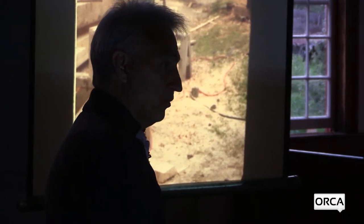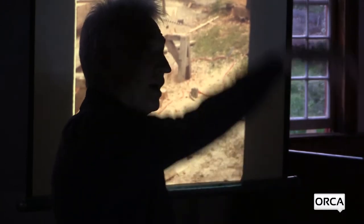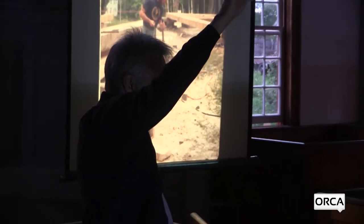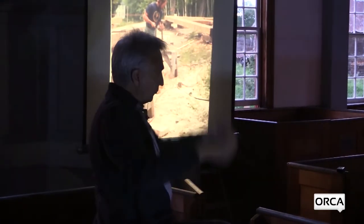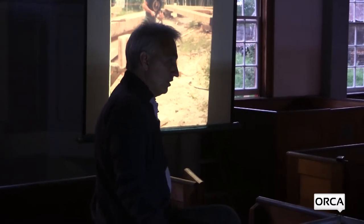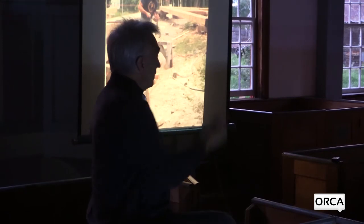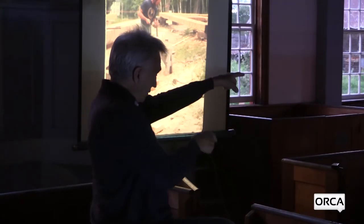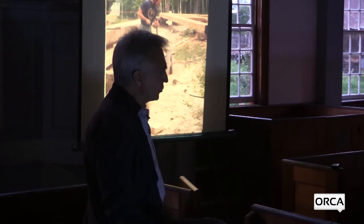There's a book by a guy named Bell, 1852, called Carpentry Made Easy, one of the more sophisticated carpentry books you'll ever read. And he describes the process. You build your tower to maybe 40, 60, 80 feet. Then you use that for scaffolding. You build the rest of the steeple inside the tower. You keep on bringing it up a little bit, and as you bring it up, you finish it and paint it, and you keep bringing it up. When it gets high enough, you throw some timbers underneath it, and your steeple's like that up there. The upper two octagons are not tightly framed into anything. They sit on sleeper beams that sit on other beams so that you can do the same thing. Yeah, some version of this was done.